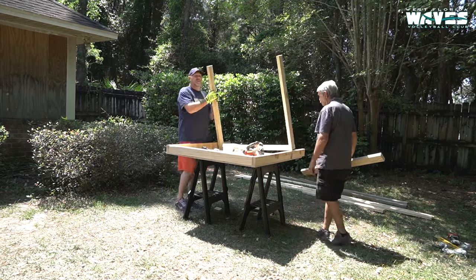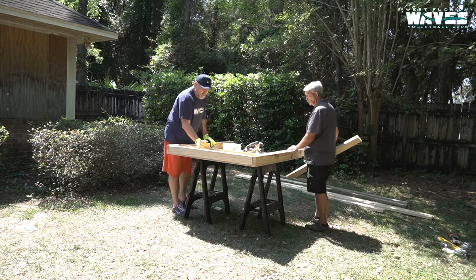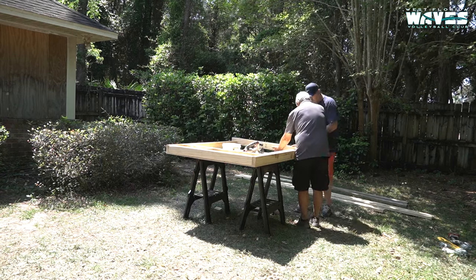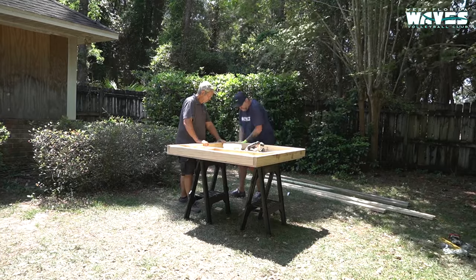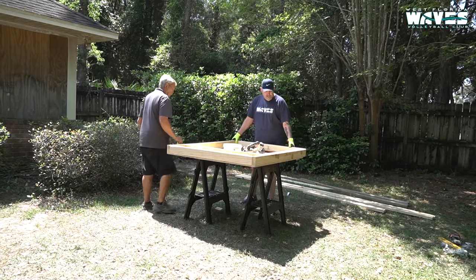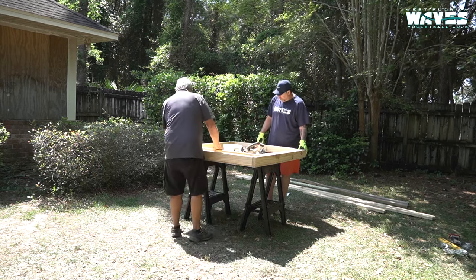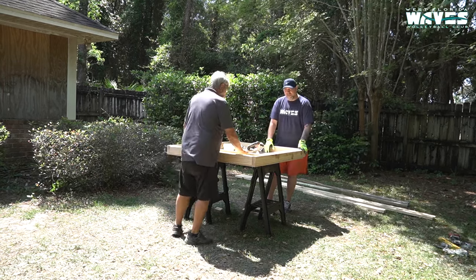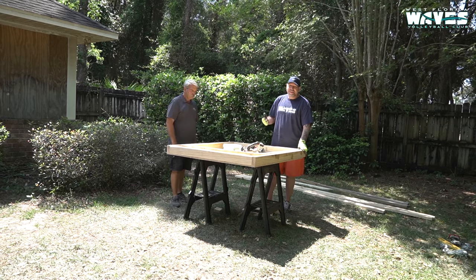Once you get this part of your frame built, you can just turn it over and put one end on the other so you've got support for where it needs to be. Another trick we learned is to take a piece of wood and block it in behind, so when you're pushing your screws in it doesn't push the box forward. Now you have the basic outline of your base — it should fit in there snugly without clearance issues and shouldn't be too wobbly. It's important that we leave these gaps where they are because we need this space to make sure it collapses. If you're not going to collapse it and you're just building a solid one, it's not critical, but I'd suggest building them this way just in case you want the option to fold them flat.